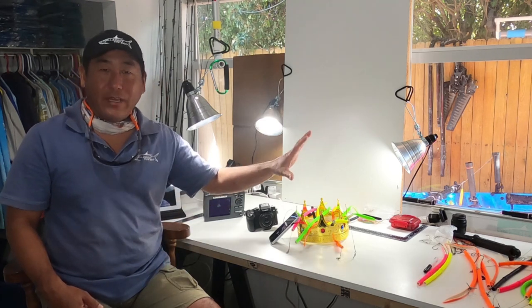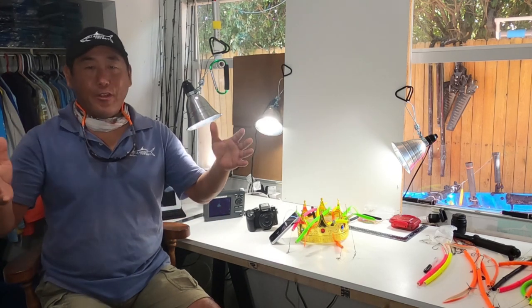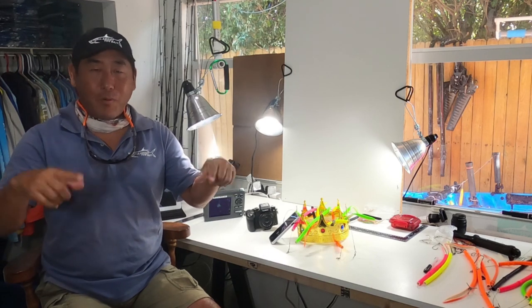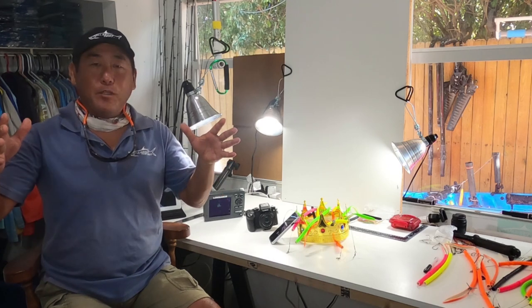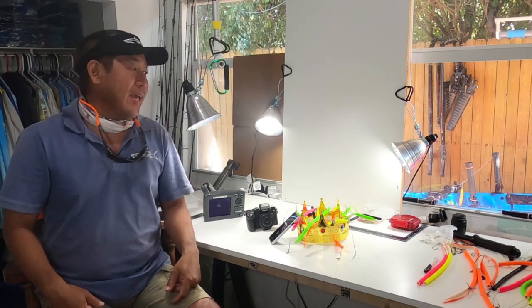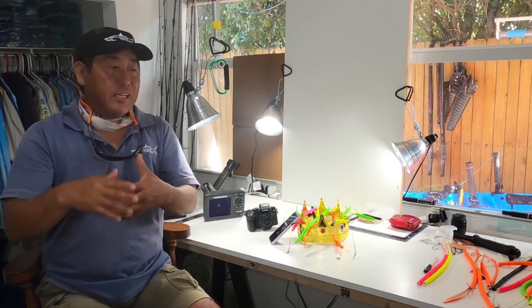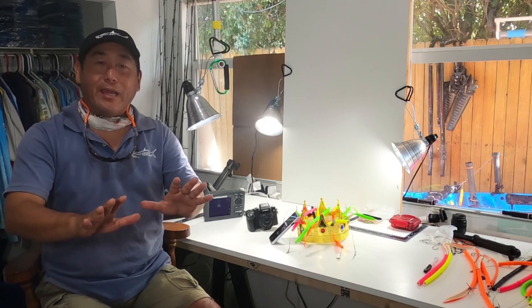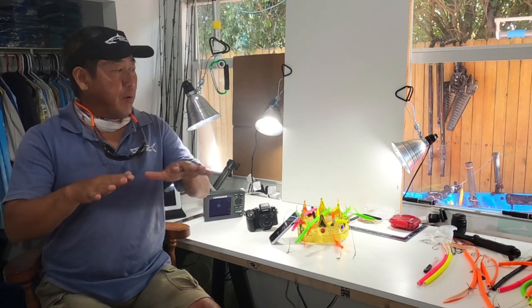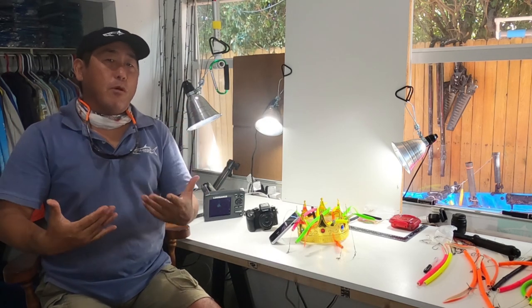In the end, the reason why I'm not running the dual outboards on there, it's just no need for it. I'd probably have to do some work in order to get both motors harmonized together. You would have to reverse the motors so you got the props going in opposite directions. You would need them to be hard-lined in, so when one turns, they both turn in order to keep yourself going straight. With the extra horsepower and the extra weight, it makes the back end dig in deeper. So all you're doing is causing more drag, so you're really not gaining very much. You would have to put some sort of system in the back, basically like a boat, to get it up on plane, and then it would be more functional.